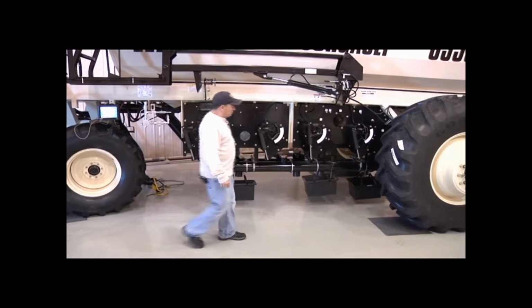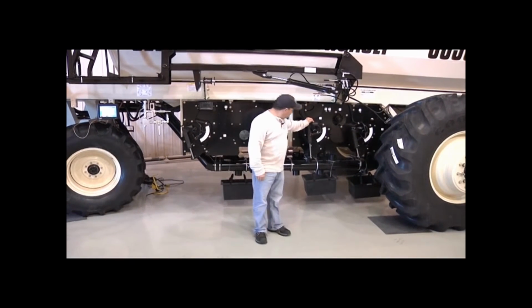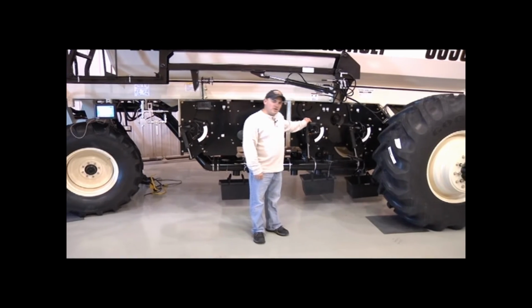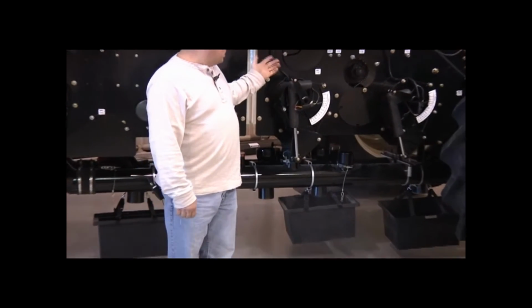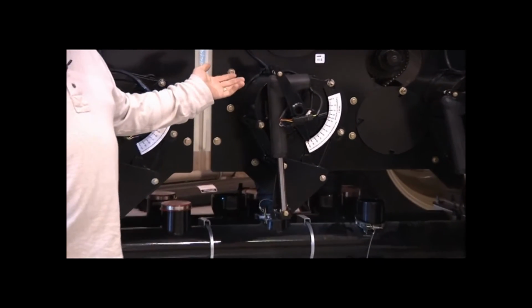As you'll notice, tank 3 has maxed out at 99. That means we're in too low of a range to hit that target with a double flight auger. So we're going to have to change our range position to medium.